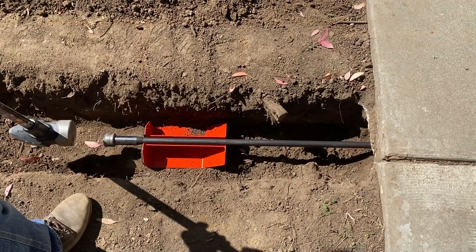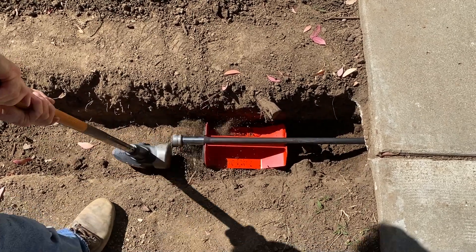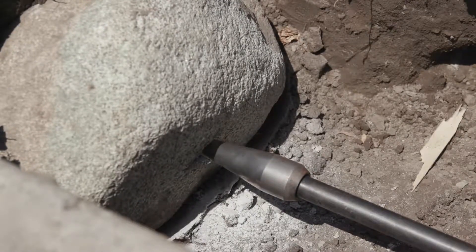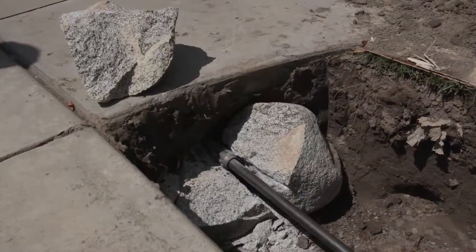The sled guide will advance automatically as the tool is driven forward. As the compression point comes in contact with rocks or buried debris, the sharp, hard point will embed itself into the rock until subsequent impact forces fracture the rock and move it out of the way as the tool advances under the pavement.